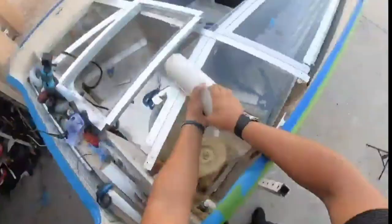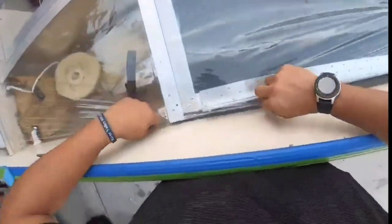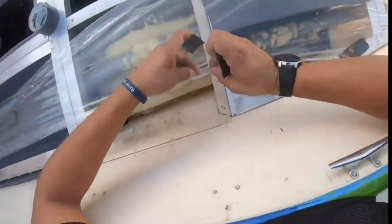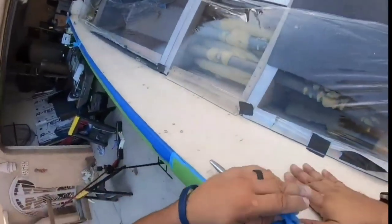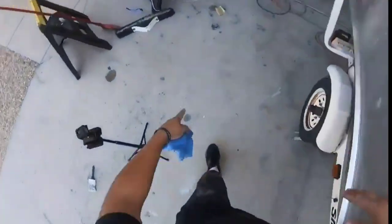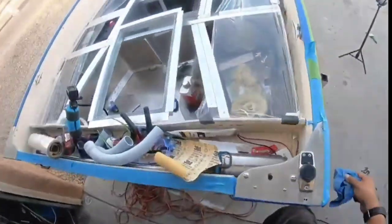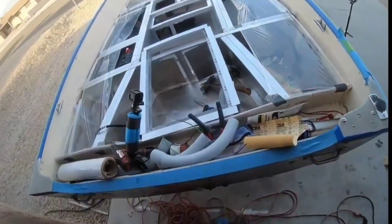The ideal situation will be for you to paint the inside and outside of your hull before you even reach this point - that way you don't have to run into complications. But if you did, make sure you wall off to prevent overspray over the crucial parts of the frame. I roughed this up with 220 grit sandpaper over there and we'll do the same to the other side. We're going to hit it with acetone and a rag, and we're going to spray paint the inside.